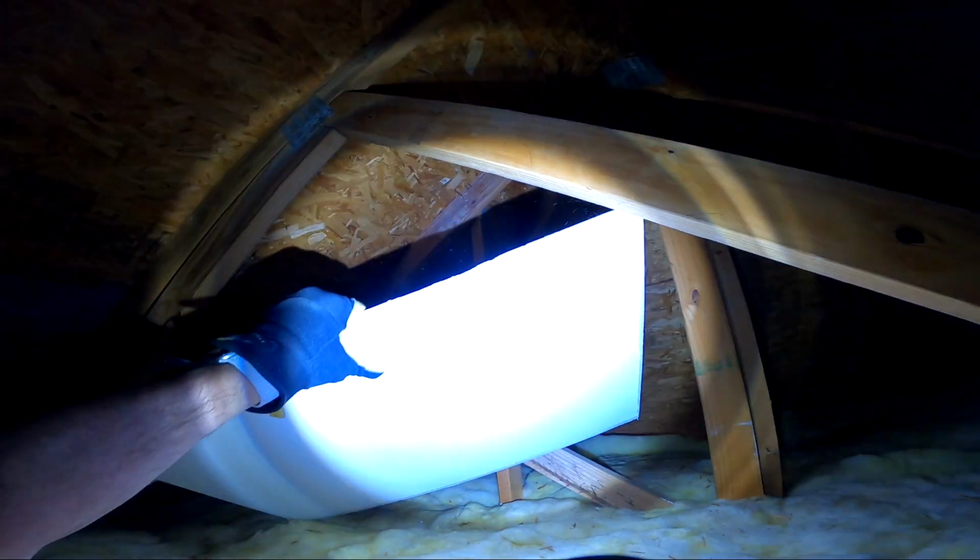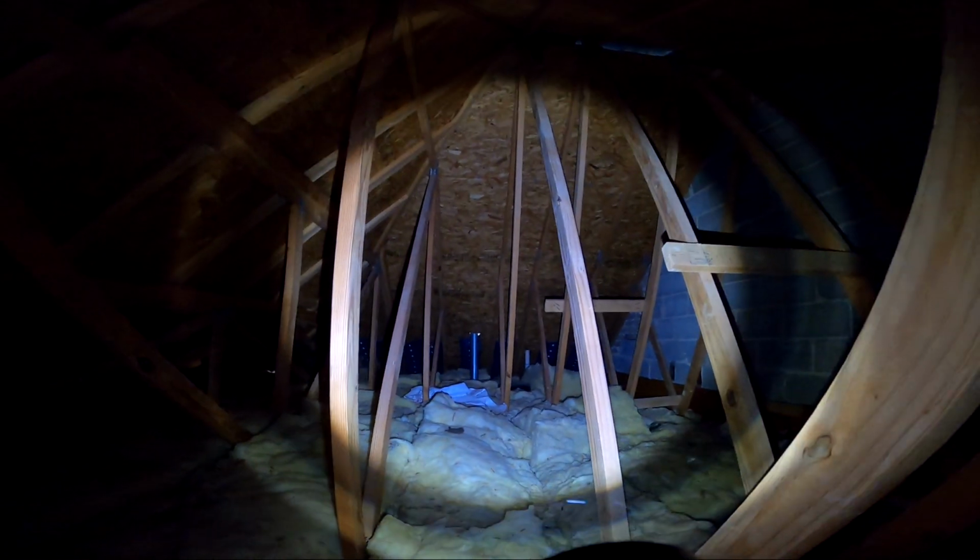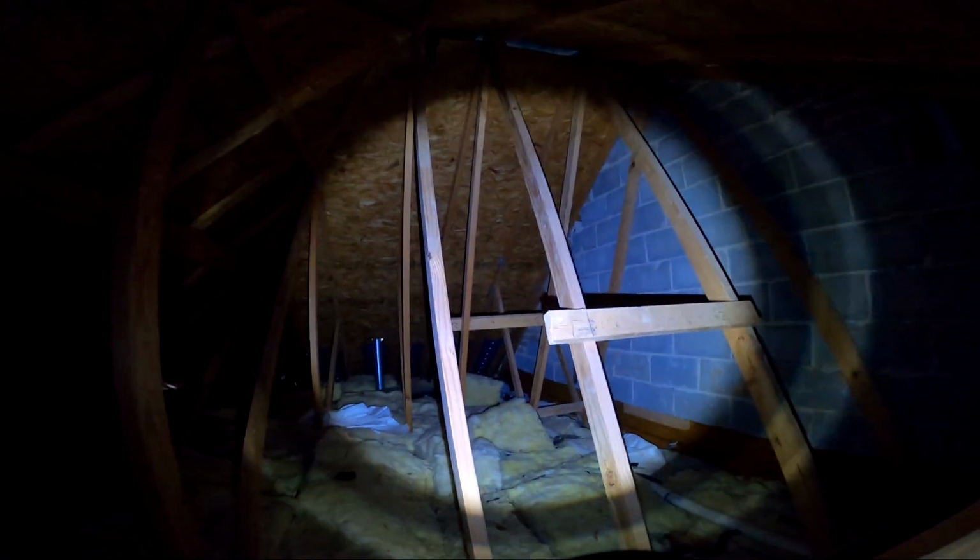And as I mentioned yesterday, you can see that the type of insulation used in that lower attic over the master bathroom is batt insulation. As I was saying, the reason it's not as effective as blown insulation is that it really has to be installed perfectly. That's not to say there wasn't some care taken here, but certainly there was one serious mistake in terms of where the insulation was placed.